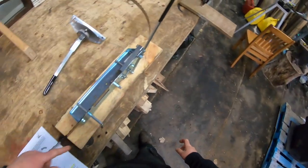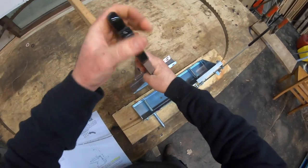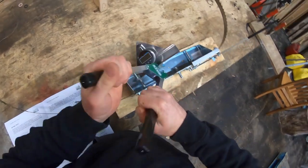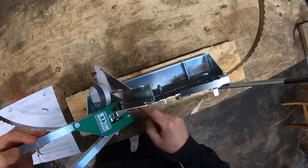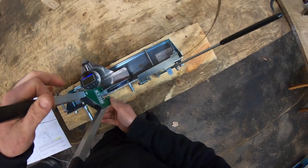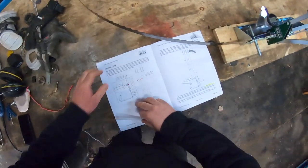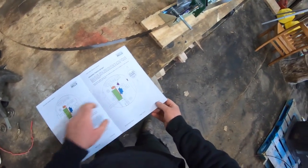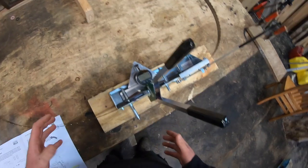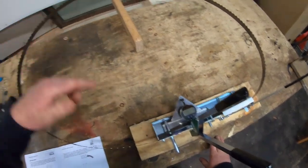There are really only two main adjustments to get this thing dialed in. First, open up the handle and when you're putting it over the blade, notice how it slides through those holes — go gentle and make sure that slot fits nicely over the blade. Don't ram it down. If you read the manual it explains all this with color-coordinated parts. A few things I learned: you need a stable base with the setter secured to something solid, and you need something for the blade to sit on.